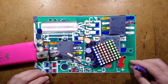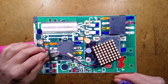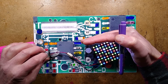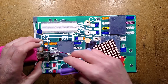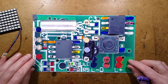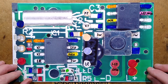Reverse engineering is complete — let's explore. As you can see from this display, it is just using standard WS2812B LEDs. You can see all the patterns including the strobe ones and stripy patterns being scrolled along the LEDs. Hideous, but functional. There are some oddities to the circuitry — one main oddity: it's using two microcontrollers. I'm not really surprised because WS2812B LEDs are notoriously quite tricky to drive, but clever.